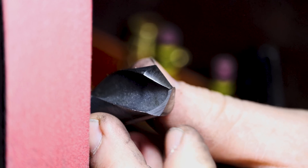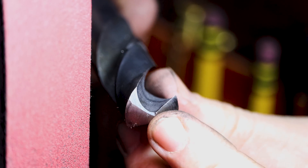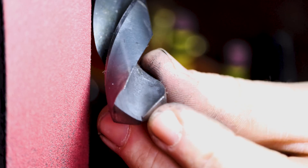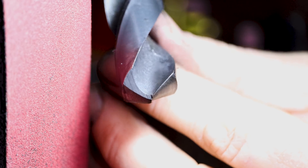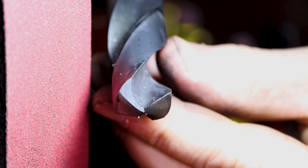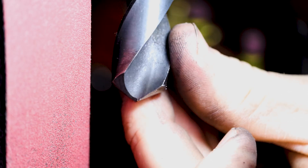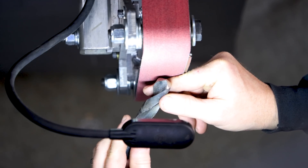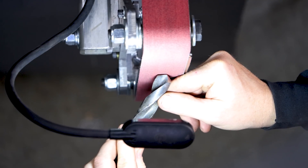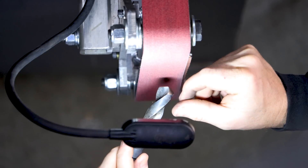The drill bit is turning and you've got two cutting edges as it's spinning, just digging into the steel as it goes down. What you're trying to achieve is matching the already pre-existing angle of the drill bit itself and giving this edge a nice sharp bite — just like a knife needs a nice bevel. Because it's curved, you're just going to match it. As we drag this across the belt you're going to see that I'm taking this edge and shaping it down, making it nice and sharp. This is where the soft platen really shines — we're going to push up against this platen, turn it clockwise to match this bevel.